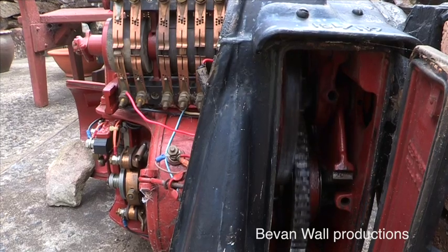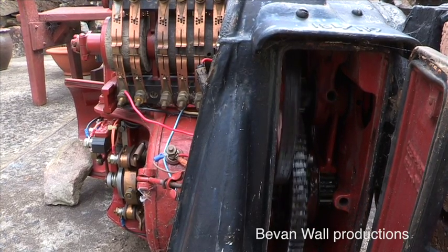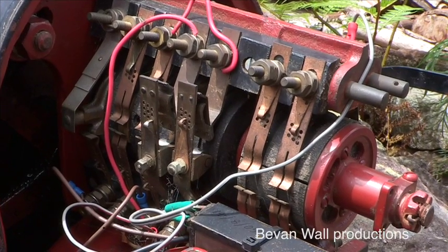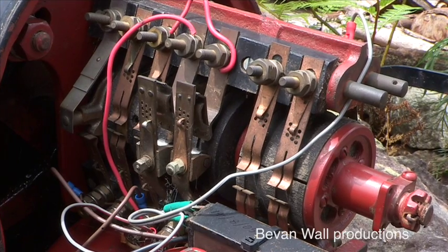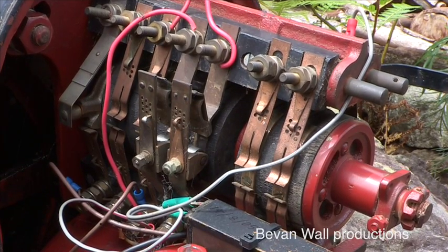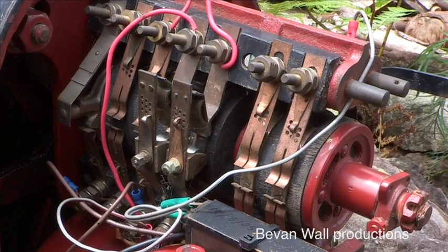Attached to the spindle is also a hub. On the hub are a number of contacts, and when the spindle reaches 45 degrees or the full 90 degrees, those contacts can be opened and or shut. That turns the power to the motor off.